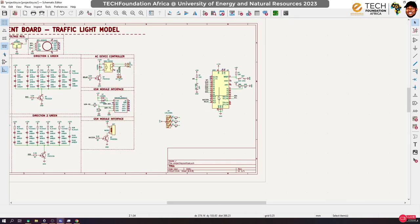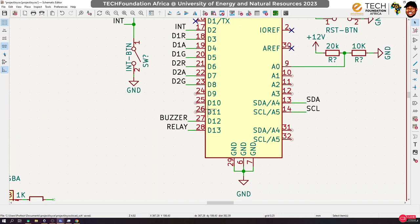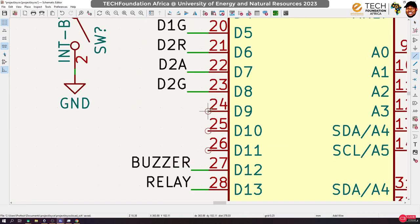And we can only use certain specific pins for this. Like I said, on the physical board these are the pins with a similar sign. There are only six of them: 3, 5, 6, 9, 10, and 11. But if you look at it, we have already used 3, 5, and 6. So we are now left with 9, 10, and 11. Okay. Those are the only pins that we can use, at least for now.